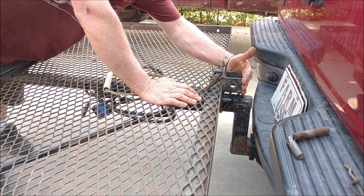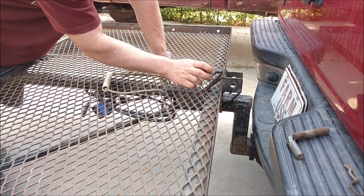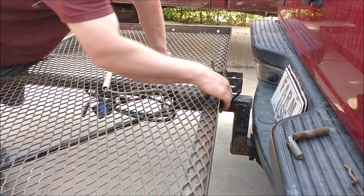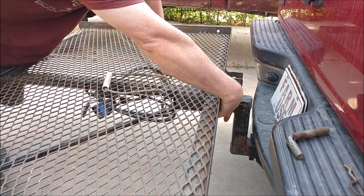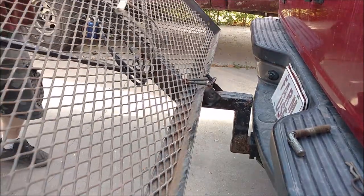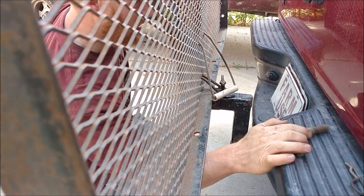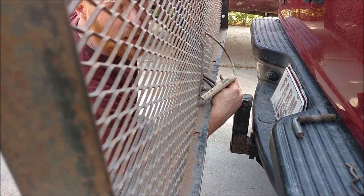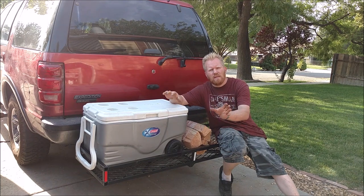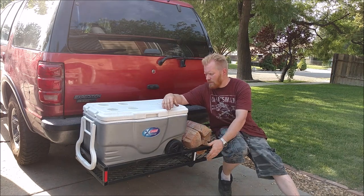So when I did this I didn't want a full square tube for the vertical mounting because I didn't want to have to slide it on — I wanted to be able to just lean it up and then screw in a screw and take out the slack. But I also had to do some bracing because it's just channel. So now you just take the pin out, use the same pin for here, slide this off, and just flip this up. Get the position just right, line up the hole, put the pin through, and then just screw this down to take out any slop or wobble. I put a couple pieces of the red and white reflective tape on — they illuminate amazingly when a headlight is even remotely on them. So those will really keep the back end of this just safe and secure, but nobody should be following this close anyway. And the headlights of the vehicle aren't blocked.